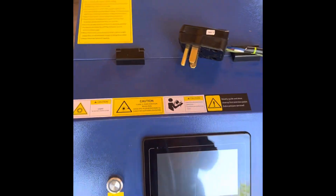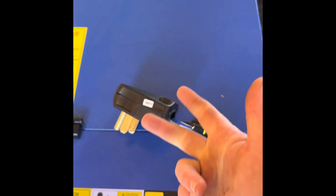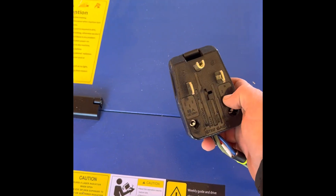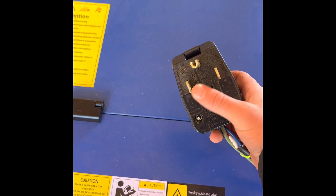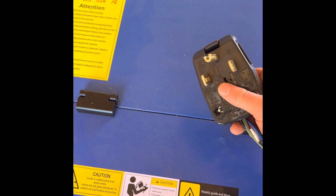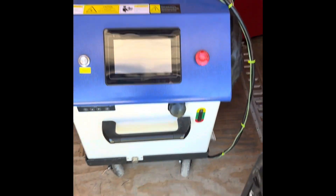You're going to need a power cord, or at least a plug. Your power cord is going to come with three bare wires: the ground, the hot, and the neutral. If you don't know what the wiring diagram looks like for one of these style plugs, you've got your ground going to the top round one, then hot on one side and neutral on the other. You don't have two hot wires on this. I clarified that with the factory to make sure I wasn't miswiring it.